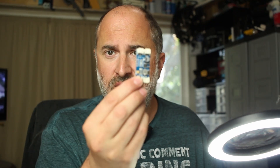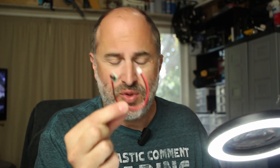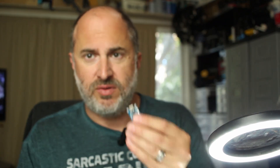In addition to having the batteries, I want to add a solar panel so that hopefully while this thing is deployed, I can gain back at least some juice from solar. The solar panel will go into this small MPPT solar charge controller, which outputs approximately four volts. Since I need five volts, I'll pop it into a little boost converter, and then into these USB lithium-ion charge controllers — five volts in, with battery connection, low-voltage cutoff, and over-voltage protection built in.